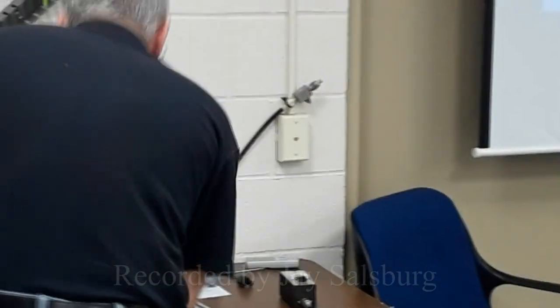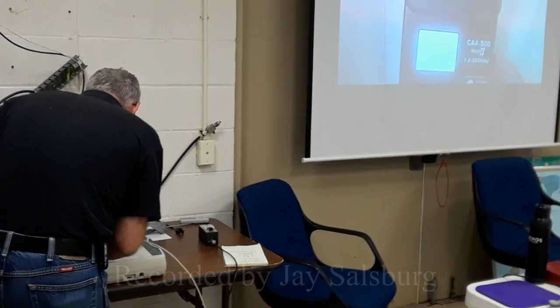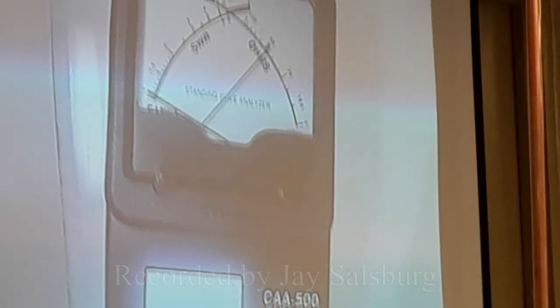Now let's take this back up to 140. Let's take this over to off. Let's take this back to here and let's set this back to 146. SWR is very low. Okay. Let's see what the bandpass is, what kind of band it has. So let's sweep again.